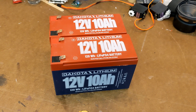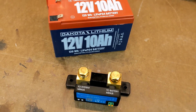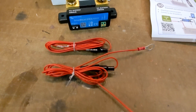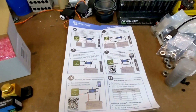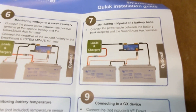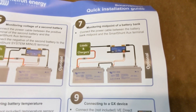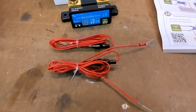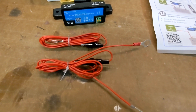I can even set an alarm to notify me when the charge state hits a user-defined threshold, so there's no more need to open up R2 to check the voltage meters. There really isn't a whole lot that comes in the box. In addition to the shunt itself, you get two fused positive leads used in various configurations to monitor the state of the battery, and a quick start guide with safety information and general hookup diagrams. The diagram we're most interested in is monitoring a bank of batteries. Since I have two batteries connected in series, I'll connect one fused lead to the battery positive and one to the midpoint. These leads I'll definitely want to use since they're fused, but they're longer than I need, so once I decide where everything is going I'll trim them down and re-terminate the ends.